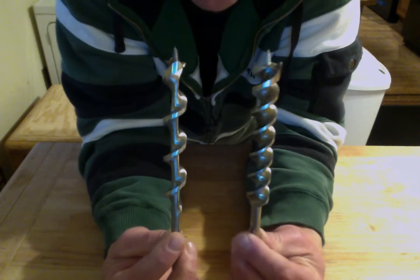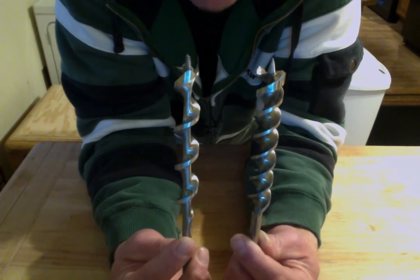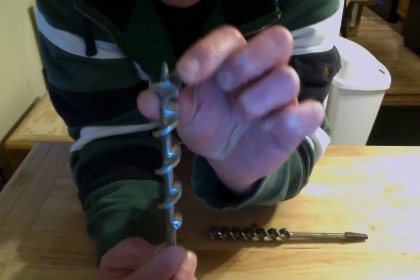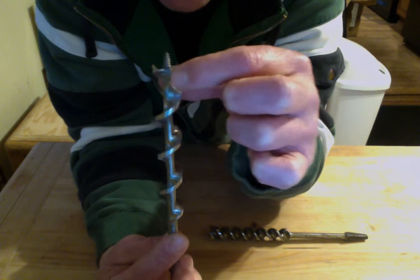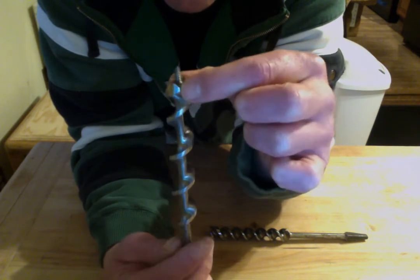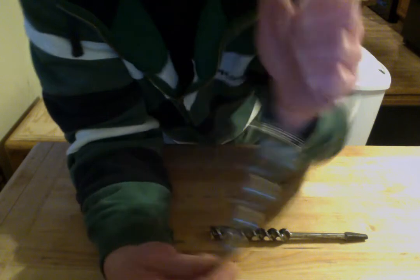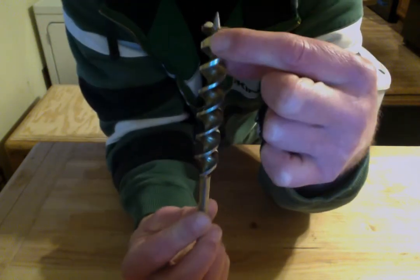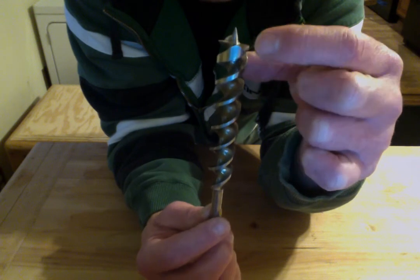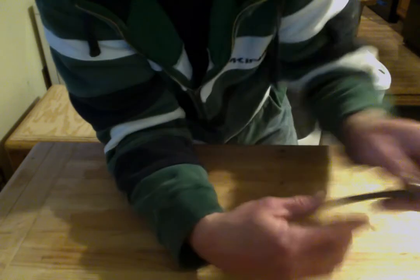There are differences between the different auger bits, and you can see right away - this one has two flutes and this one only has one flute. What I mean by that: if you take this one and follow that flute around, it disappears right there. On the other one, the flute continues all the way down. On this one, both cutting edges have their own flute - that's a single versus double flute difference.